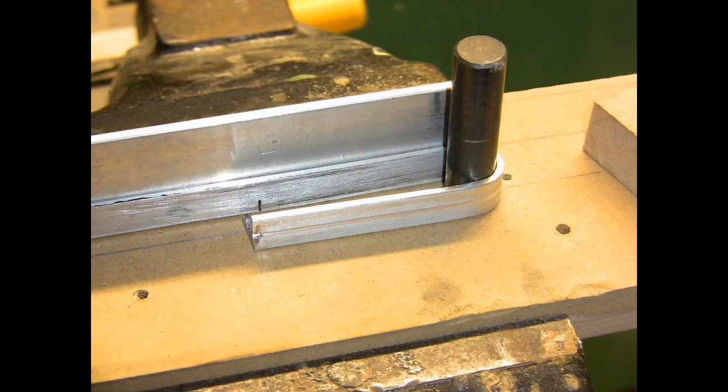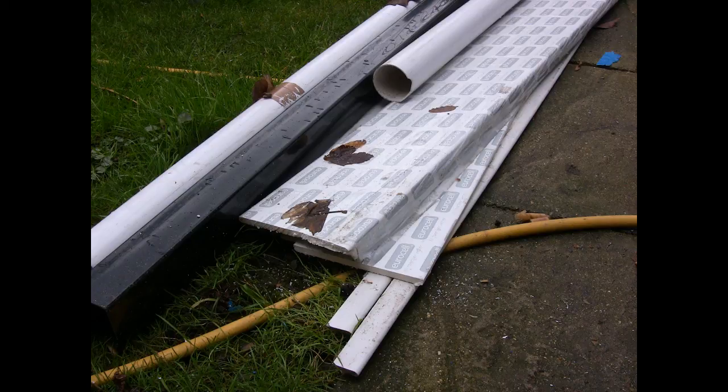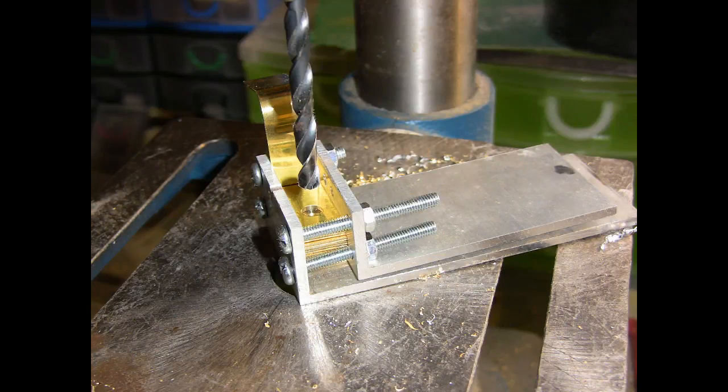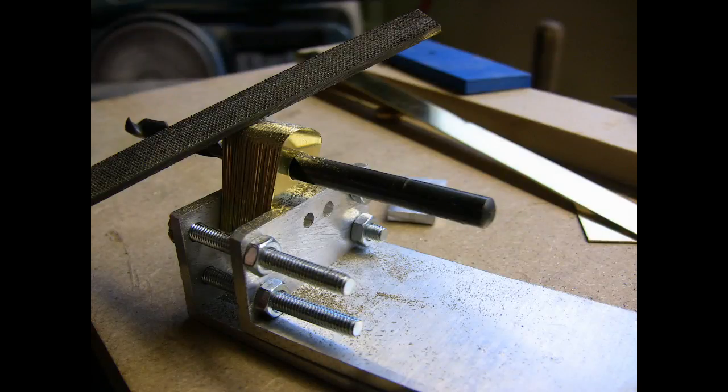We obviously need four of these, and having a little jig like this gets them all exactly the same. Then we need something to fill in the centres, and so building plastic is easy to work — we soon have that cut down and sanded to shape. Then we need something to represent the brass bearings, and I found some 13mm brass strip at my model shop — hence the reason why I used 13mm drills to make the straps. I drilled them all out together in a little jig that I made, which kept them all exactly the same, and then I was able to file them down to roughly the right size. And so we're well on the way to getting the parallel motion completed.